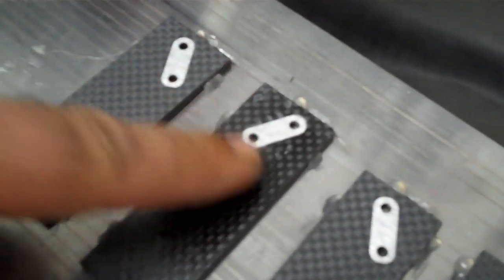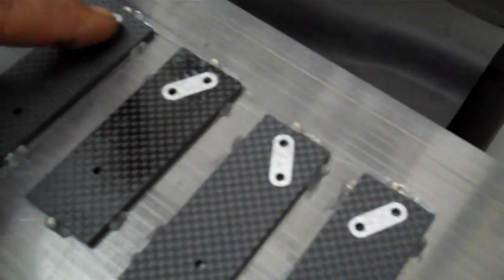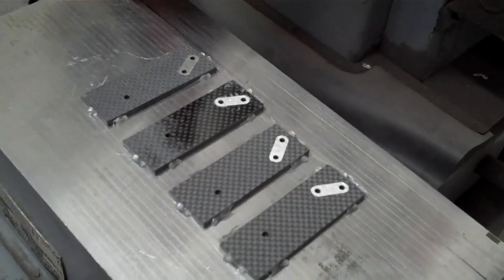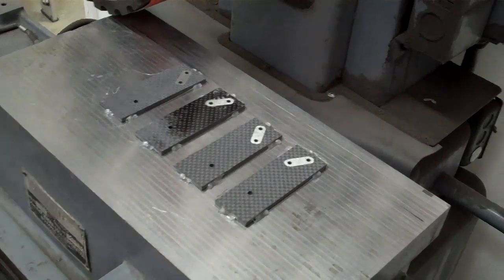Now we can look at it, and I can see I didn't get 100% clean up on this one — still a little proud there. These are all 100% though. The finish is a little rougher than I like, so I'm actually not going to use this really rough 120 belt — I'll switch to a 220. With the 220 I'll get 100% clean up and a nicer finish inside. Not that it matters for this, but we're going for overkill on this project, so once you're going for overkill there's just no limit. I'm not going to record the next version because it's pretty much just the same thing — surface grinding the material down to thickness.